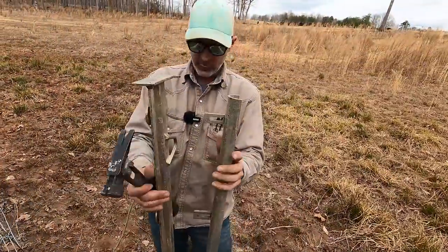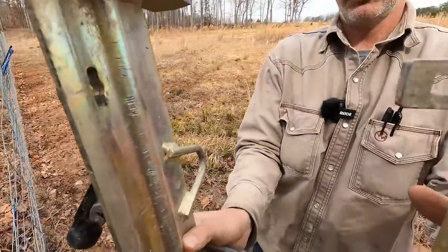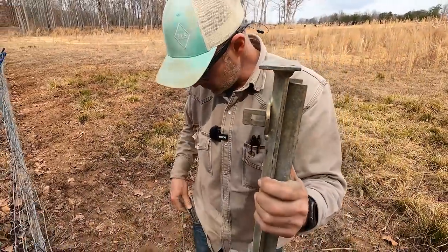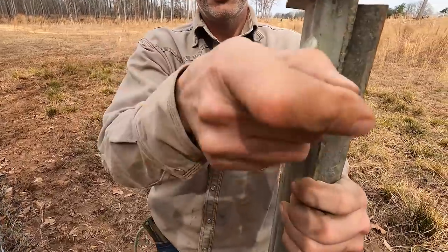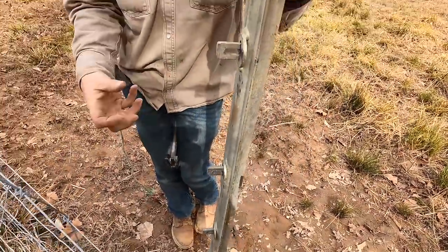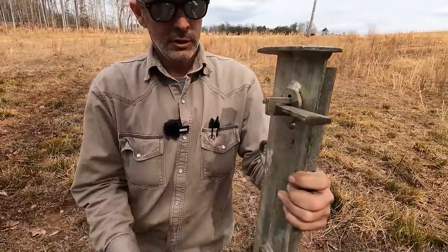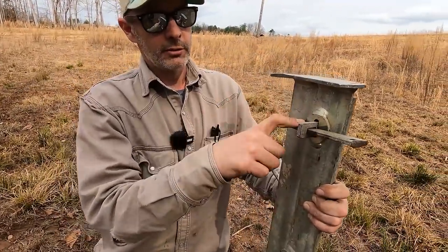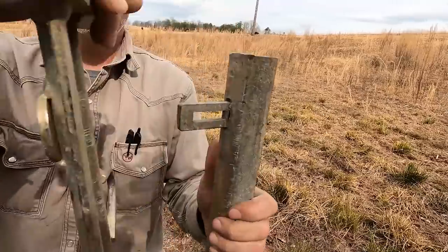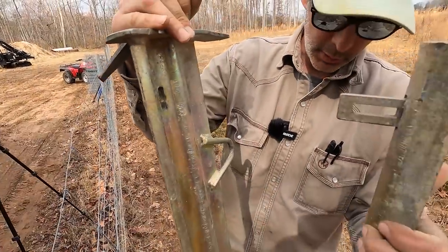So the way that this wedge board works is you've got a profile on this side that matches the profile on this side. And then once this is slipped through around the wire, we use the wedges as a tensioning device, drive those tight all the way down. So there's no bolts or nuts to lose there, and it's just using a hammer. Also, the benefit of this is that the wedge never touches the wire. So that wire is sandwiched in there on the smooth interior, and you don't do anything to damage the surface of your wire.